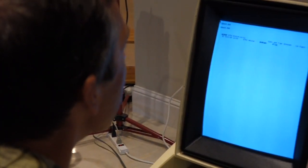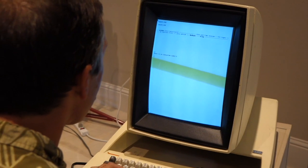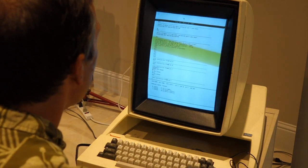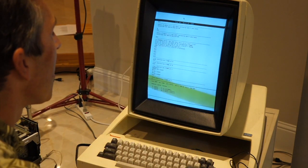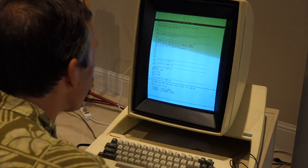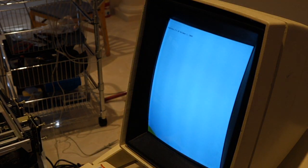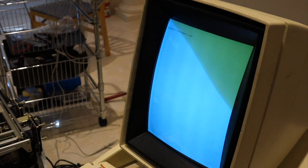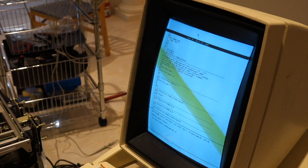Bravo is the editor. You can see the disk is doing a lot — you can hear it. I tried running draw and that dropped us into the SWAT debugger. We might have a memory problem or something. It does a lot of things right, though. It says which instruction it crashes at — instruction 72400. So there's maybe one instruction that's not running correctly.